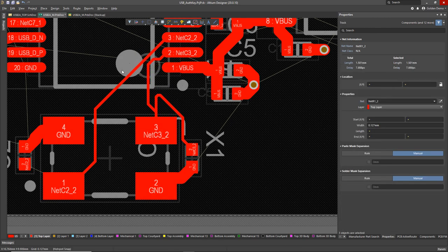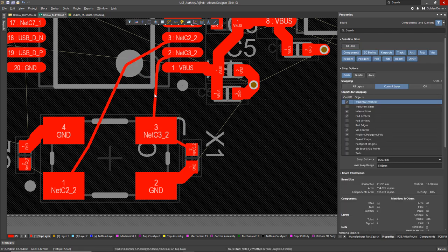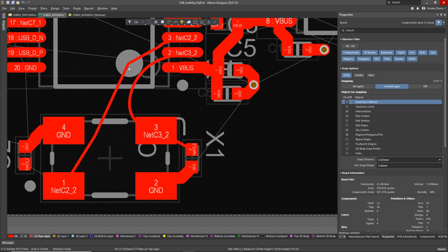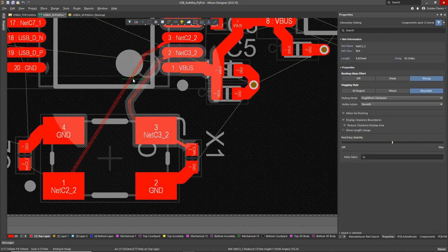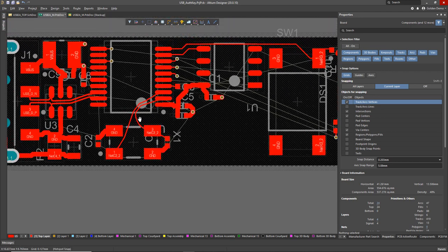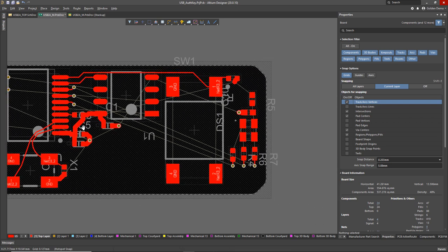I had the wrong net wire set there so I made a mess, but I'll just select those, hit Tab to select the whole connection, and gloss — that's made a beautiful curvy, neat and tidy result. I can edit it afterwards as well and push things around a bit. Anyway, not to spend too much time on that — it's going to work just fine for my purposes; it's only 12 megahertz.